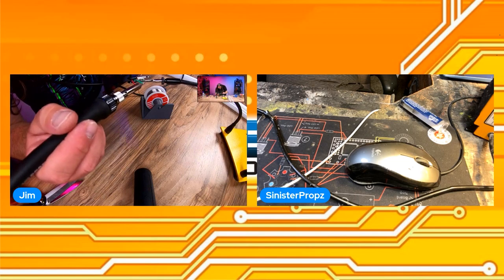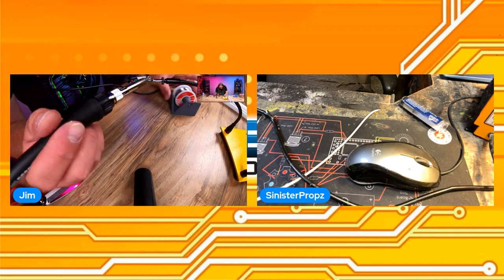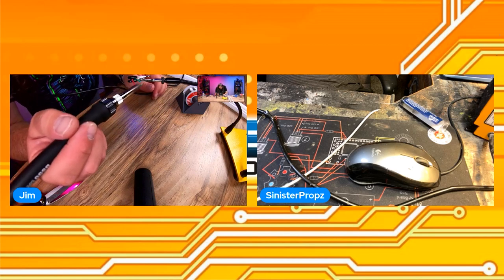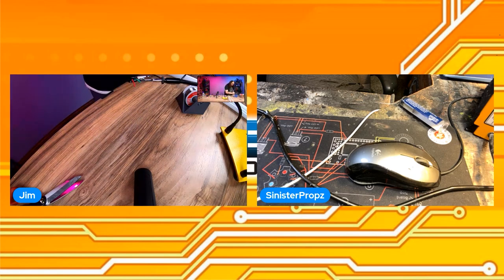And I would highly suggest if you do this, don't make it your first soldering event. No, this is not the way to learn soldering. You can get these things called breadboards. Yes, and we have one. I'll show you what it looks like. Empty boards, and you can practice soldering wires laid flat. You could practice soldering them through the holes. You can see what tips work better for your soldering iron.